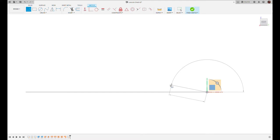For me, the neck plane is 90 millimeters long. I discovered over the years that with 90 millimeters, I'm all right for all the scale lengths I use, from 24 inch to 28 inch for baritone guitar. 90 millimeters works great for all those scales. It's perfect. It's one of the sizes I never changed in 5 years, in fact. So I keep the 90 millimeters, but maybe for you it would be other. Okay.